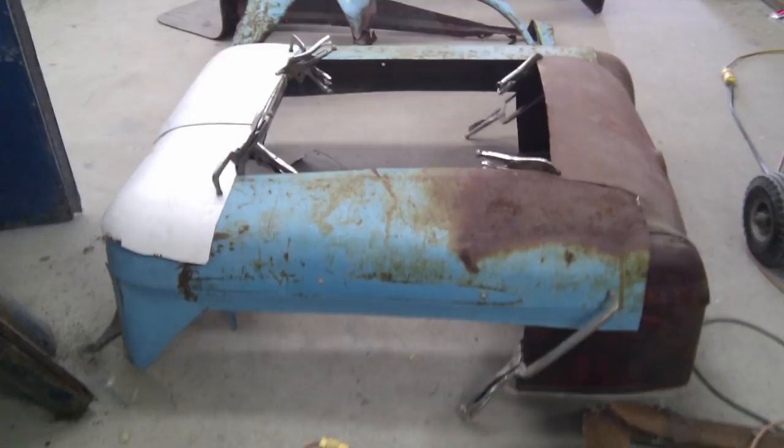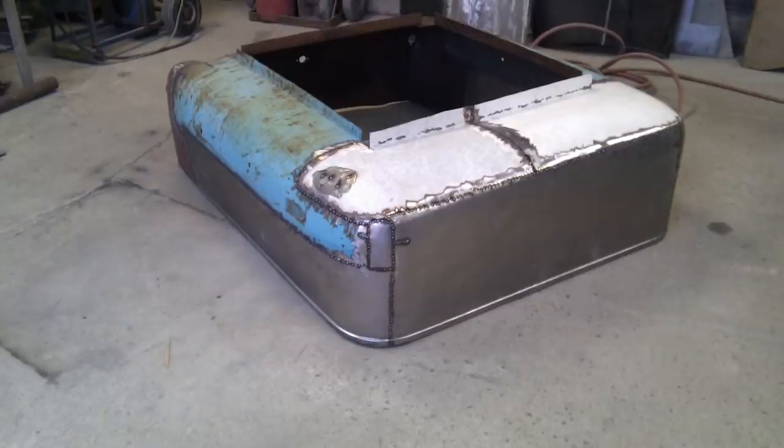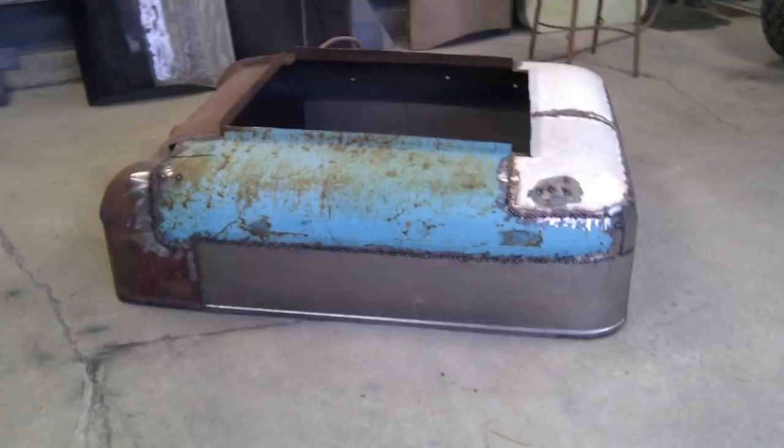I just started piecing things together and cutting as I went — there was no cut-out on this. I wasn't sure what it was going to come out like. Everything was just a lap joint and welded together. I never got fussy trying to have everything perfect; it was just a little project I was playing around with in the evenings after work. I ended up having to get some sheet steel and close the bottom side of it, and ran a little bead around the bottom just to give it a bit of strength and to follow along with the Crosley rear-end section.